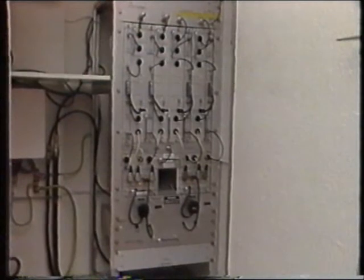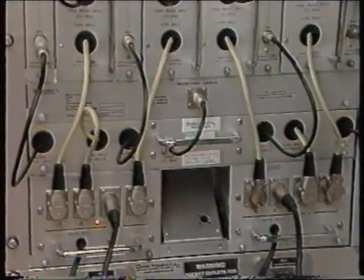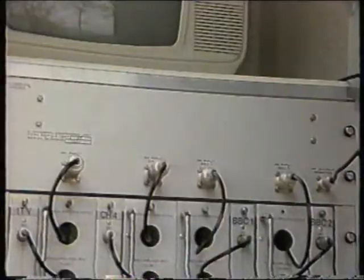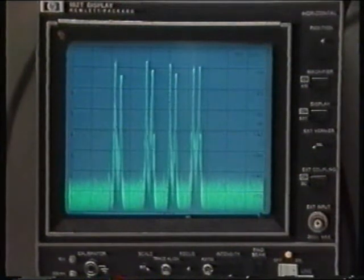Inside the building there is not a lot of room, which in some respects limits the amount of test equipment that can be used. The receiving aerial splitter is an active device and supplies all four Silver Streak transposers. The output feeder is fed via the four-channel combiner at the top of the unit. Basic on-station monitoring is provided by a monochrome receiver. The input signals being received by a transposer are displayed on a UHF spectrum analyzer.